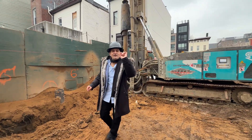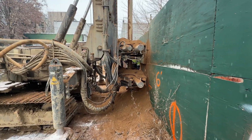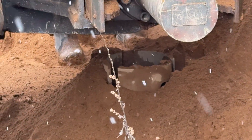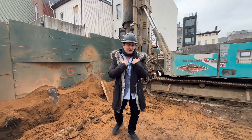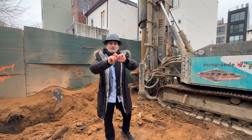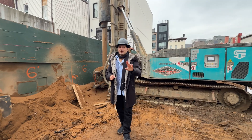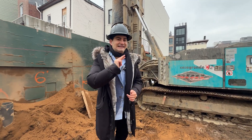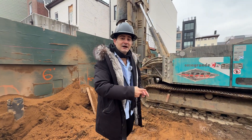As you can see, the stakeout team has marked the piles at six feet apart. Typically they're four to eight feet apart, though in some instances you have 36 inches depending on the situation. The engineer pre-mapped everything — we didn't have to figure that out; he gave us plans that we cross-referenced with the pile contractor. These piles will be done in one more business day, and we're doing everything in parallel — still doing underpinning on the second section while installing the raker.